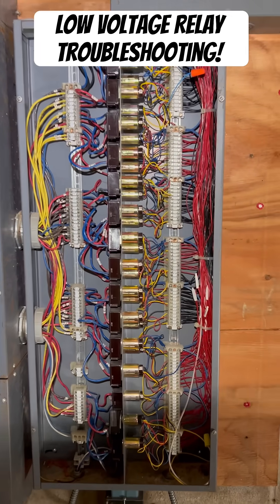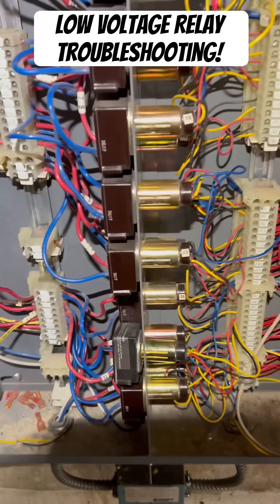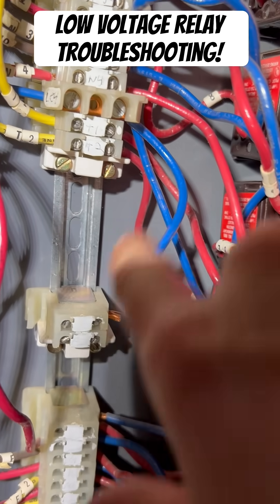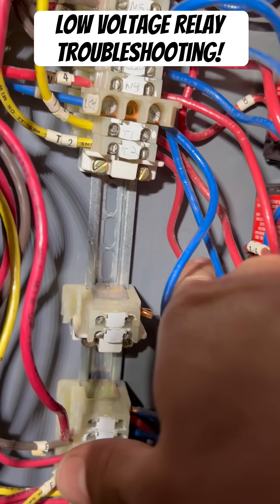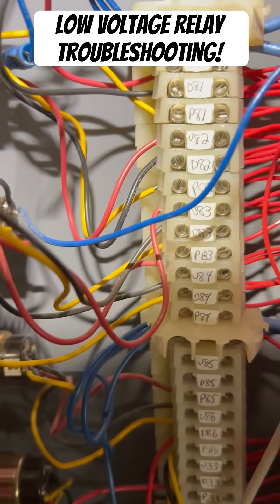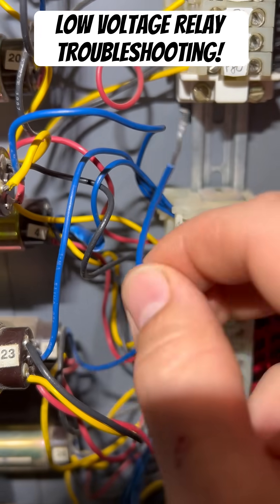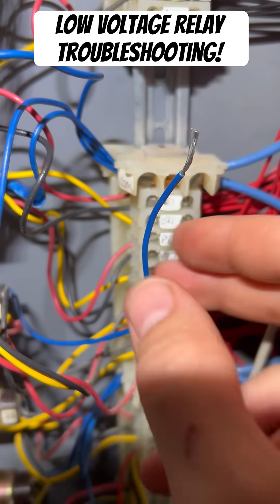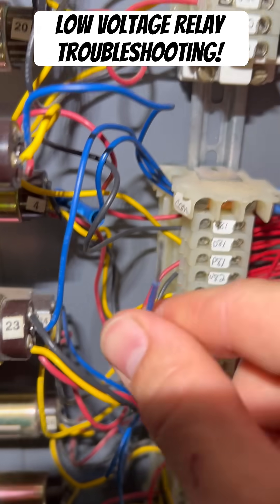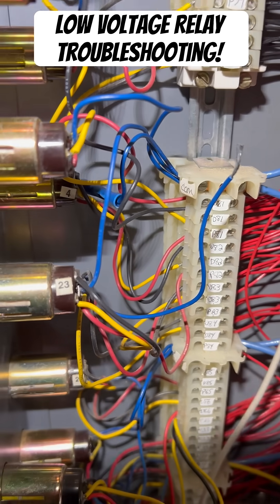Happy Friday everybody, we're in Dighton, Massachusetts working on this low voltage relay system. We're troubleshooting why the light wouldn't turn on, and now it only stays on. Here's the com wire and the 120-volt switch leg on T2. I found this small wire chilling behind there — that's the low voltage feed for the 24 volts on the com wire. We're trying to figure out if this was bypassed, fell out of the crimp connector, or if the relay was bad and someone pulled the wire so the switch wouldn't work.